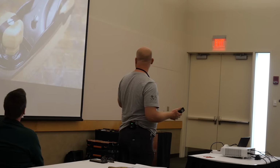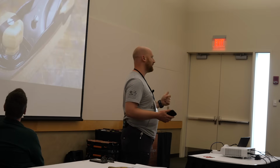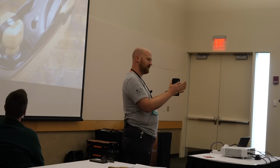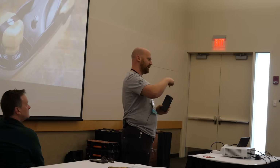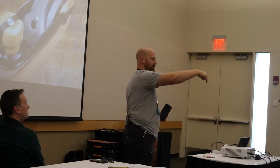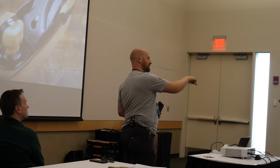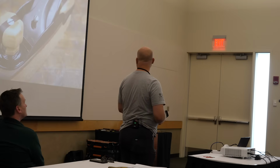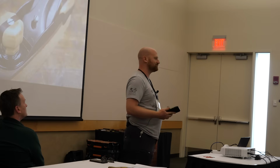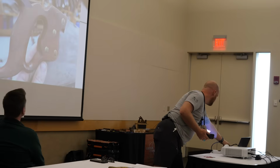But I had this torrefied hard maple that would be great, but the piece was too small. So I had a piece of maple on either side and actually sandwiched it. And I lined up the grain so it looked like the wavy grain on the maple actually went right through the torrefied section and then back onto the regular maple. So the grain matches from one end to the other. Is it traditional? No. Octagonal too. I really had fun with that one. And it's just an interesting way to do some expression on it.